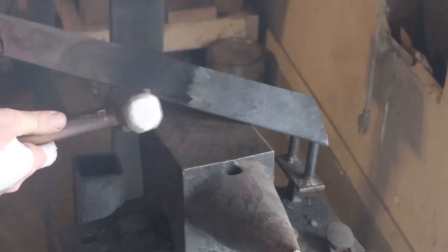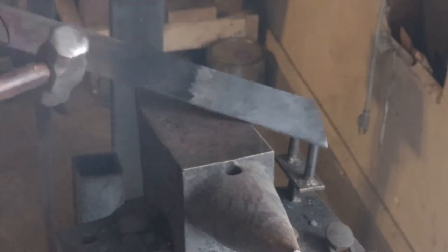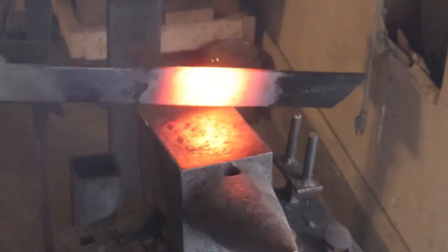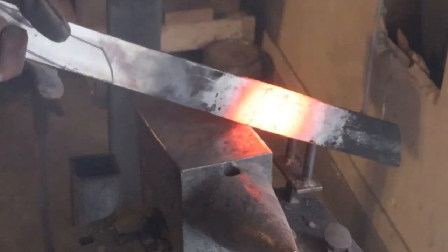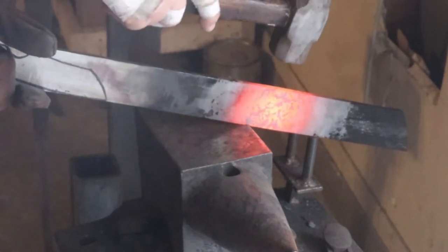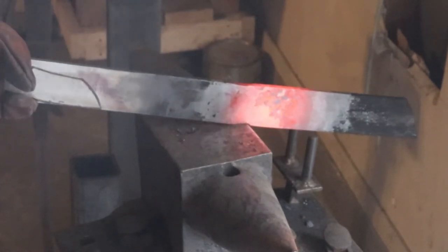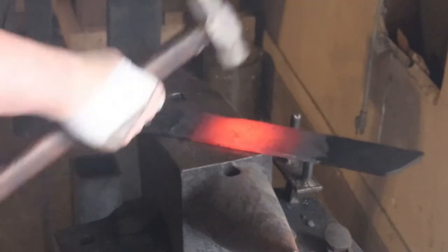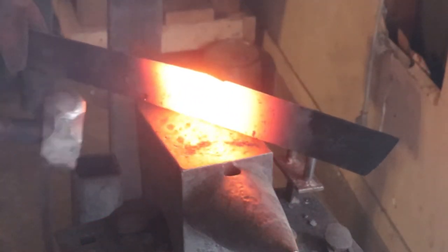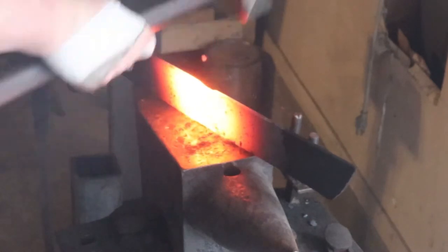Make sure you forge the tang in on the correct side. Where the taper on the tip is — this is actually going to be the spine of the blade, not the cutting edge. So I'm going to forge in from this direction for the tang. Now we're going to do a set down: find that spot right on the edge of the anvil, angle the workpiece, and hit it on the back using the rounding face of the hammer, half on and half off the anvil. Another way I really prefer is to use a straight-peen hammer — lay it flat and just take it down.